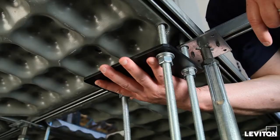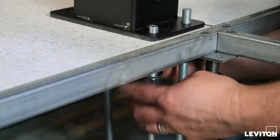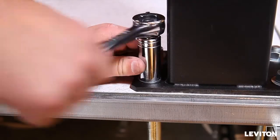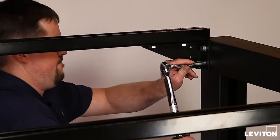Adjust the underfloor and abovefloor nut assemblies to ensure the raised floor panels are level, and tighten the assemblies to assure sufficient clamping of the upright foot and subfloor plate to the floor panels. Then torque to the manufacturer's recommended value. Finally, tighten all the cross-member to upright bolts to 25 pounds of torque.